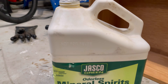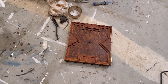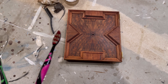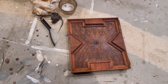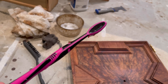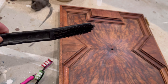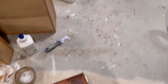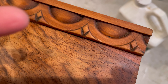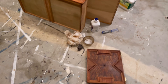I am done scrubbing and cleaning these two drawers and this cabinet door. Here's a little tip: do you notice all the edging along this cabinet door? To get around the edges, use soft nylon bristles — not wire bristles, because they will scratch the wood. I use medium-hard toothbrushes from the dollar store. These work great for getting into the nooks and crannies, along with a nice big nylon brush. Getting the finish out of those edges was a little time-consuming, but I am so happy with how this furniture stripper is working.